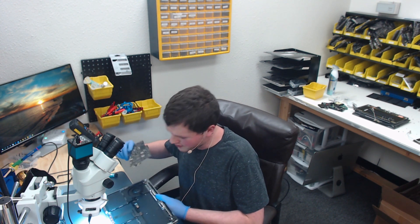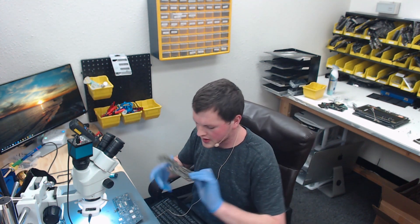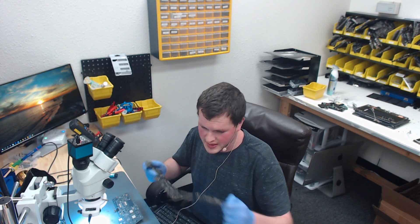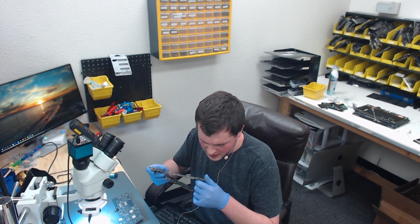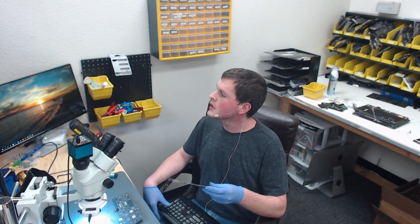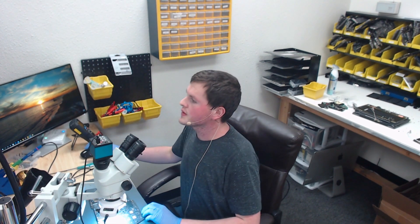This machine may have actually been under warranty, but warranty doesn't really mean anything right now when everyone is closed. So, 330 microfarad caps — let's find some. The caps aren't board specific. People ask where to find caps, and the answer is donor boards — you just have to look for them. I found a couple on a different model donor board — a 2018 MacBook Air. Let's switch over to our microscope camera and go ahead and replace these.